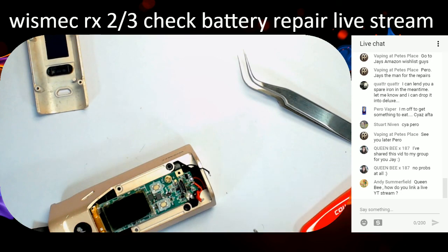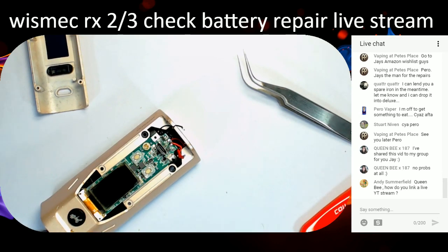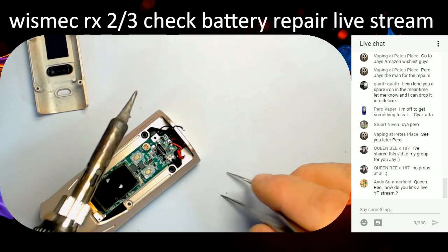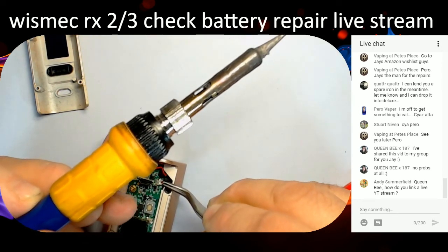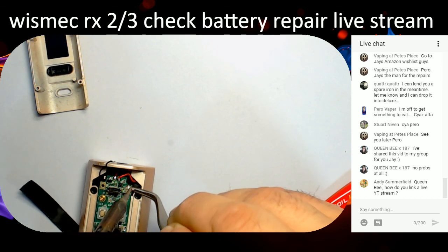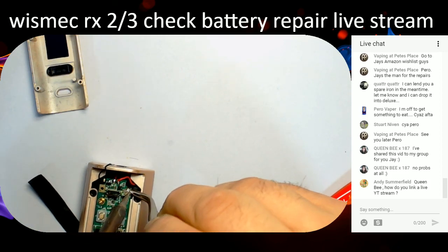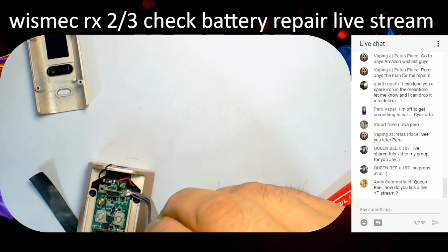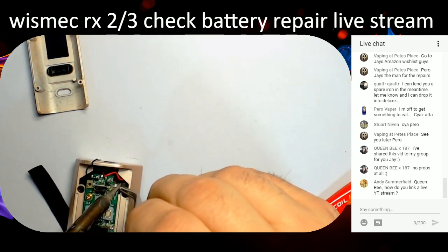What we've got to do now is get that wire there, that little red one, it's very, very tiny, just here, to go in there. This is where the awkwardness happens. So what we've got to do is get that wire there to go in. This one's always a fiddle to get in because of the way it's shaped. Solder needed on that. Put loads of solder on and then just blob it and it'll solder on then. Well, there you go.